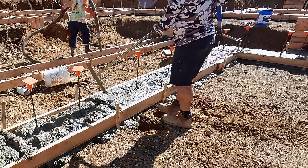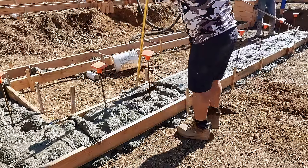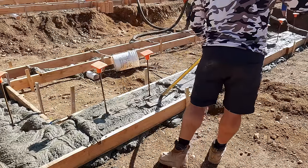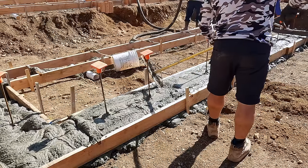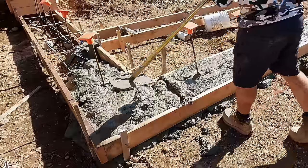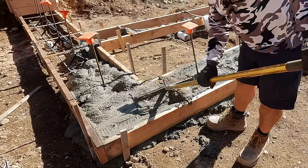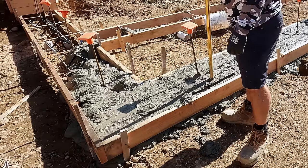Don't overwork your guys for the sake of two five-gallon buckets. There's a lot of work that would go into trying to prevent that. You could fill your footings with plastic, or use something like the fast-form system, which I'd like to try — but to save two five-gallon buckets of concrete, it is not worth any of that other labor. We work hard enough. That's just my opinion, but I'm not doing it. No way.